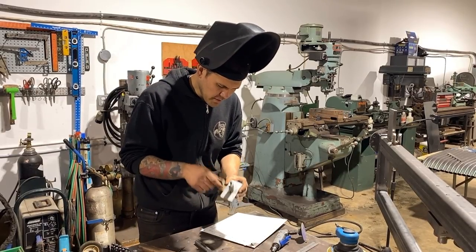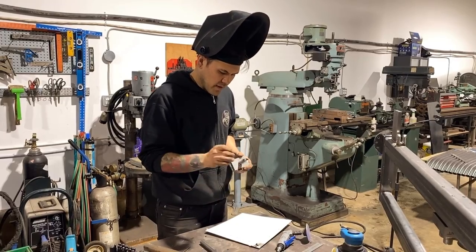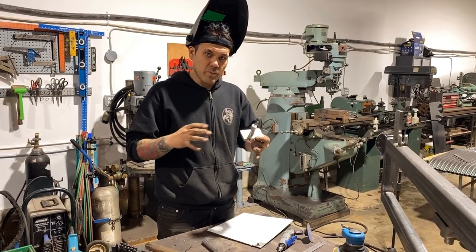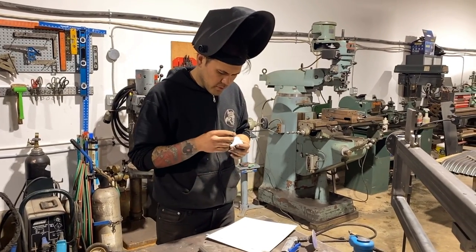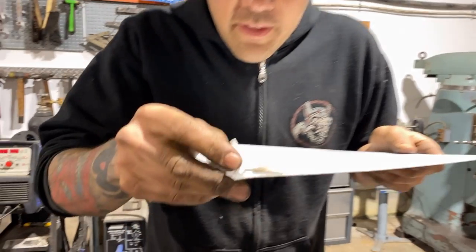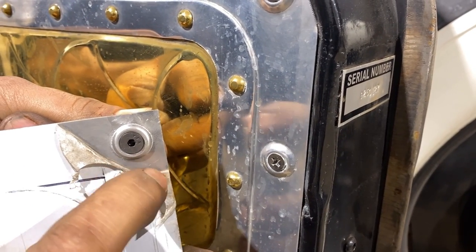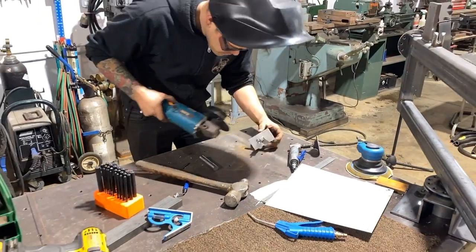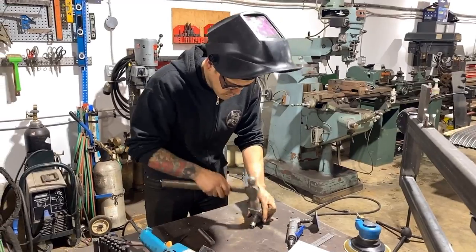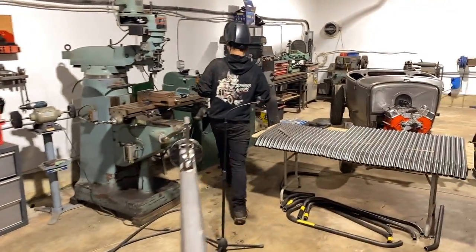Okay, what I'm gonna do is I'm gonna break these tacks. I'm gonna make our outside a little bit bigger so that there's more area for the metal to take that stretch. I might just make it a little bit shallower. See, what's happened here is, I think this is just a bit too sharp. I'm gonna compare it to my truck here. This one, I think, is just a little bit sharper than this one. So I'm gonna make this one a little bit wider, I think. It'd be a little better. Okay, back to the lathe for just a quick touch-up.